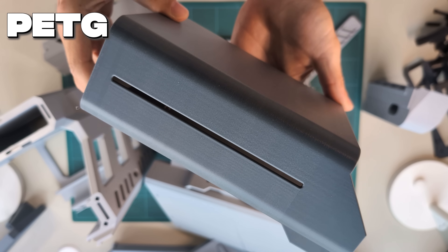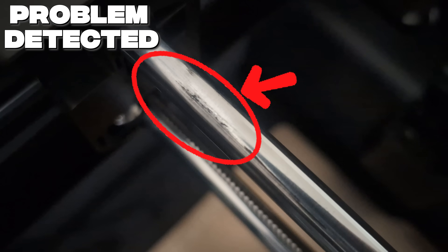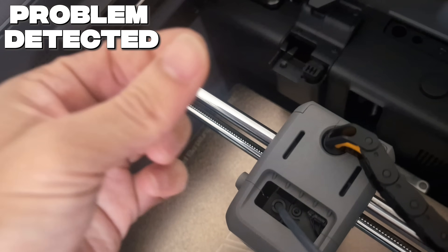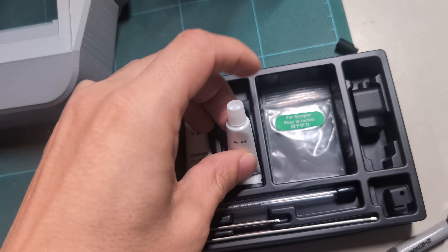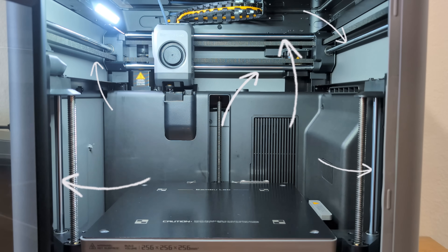Print quality overall looks very good. However I noticed black stripes on the guide rods of the tool head, probably from abrasion of the slide bearings — they were absolutely not greased at all. Cleaning them and applying some grease fixed the problem. If you get a P2S, it's best to check right away whether these rods have been greased so this doesn't happen to you.